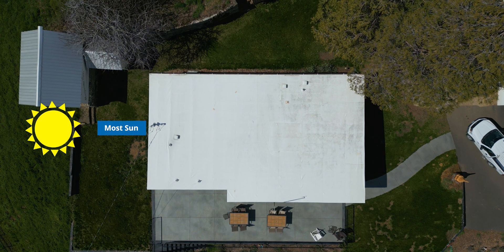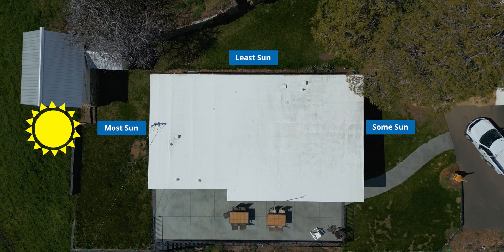For example, a shady side probably doesn't need as much water as a side that's constantly in the sun. Foundation watering is mostly required in states with hot, dry climates. Uneven soil moisture can cause imbalances, which pushes or pulls against the foundation.